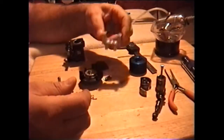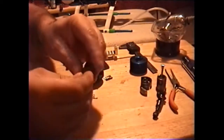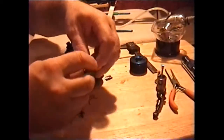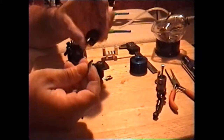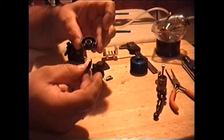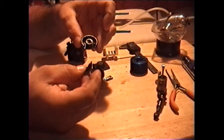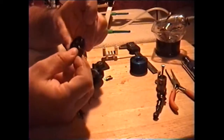Basically, your motor mount, I mean, it's a fairly simple motor. This one had the pull start, and I removed that to even try to start it because people were thinking the pull start was hanging up, but it wasn't that. In the meantime, the start shaft is still in the bird. I've got to try to get it out because it snapped above the bearing. And this is what happened to the clutch. It rattled the pot trying to start. Then when I got it started, I was holding the blades and it was at high idle to keep the motor running. I guess from high idle it just cooked the clutch and wore a thin spot where it's ribbed, and it snapped.